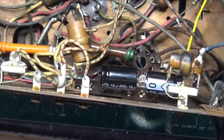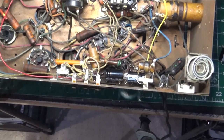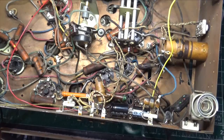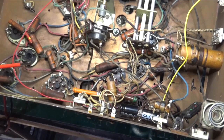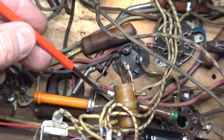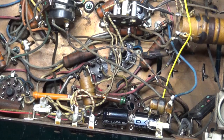That yellow wire will run to our rectifier tube — right down here at pin 8. Our second 16-microfarad cap runs over to the 6P5G tube, replacing a crusty existing wire. Our last wire for the 4-microfarad cap is just a short home run down to a terminal strip mounted here, with another red wire coming right to it.